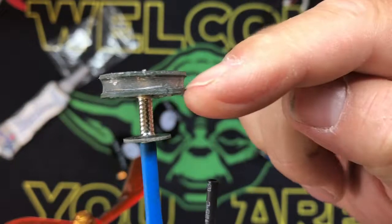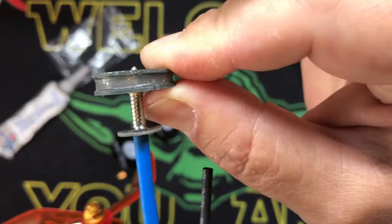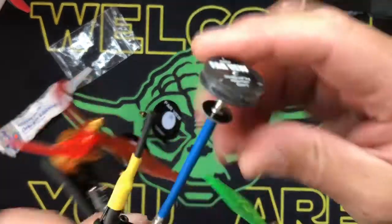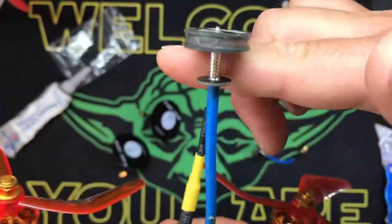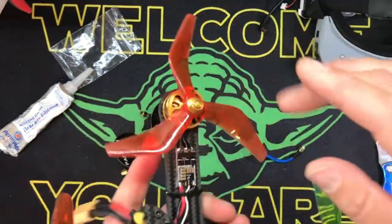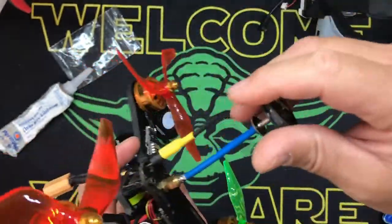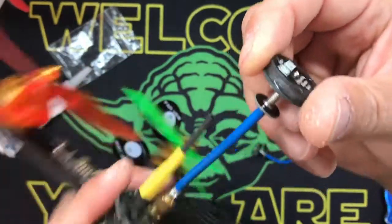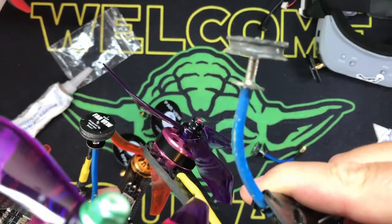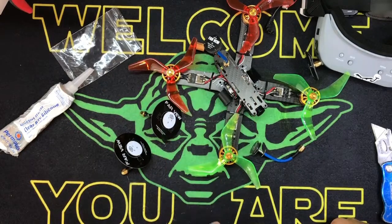Then take your finger with a rubber glove - because silicone is annoying to get off your fingers - and smear it in there, let it sit overnight. What this does is keeps these discs from collapsing together in a crash. These two discs and the third are your tuning - if you crash and they get bent together, your frequency is going to suffer. This is something you absolutely should do whether you're using a FarView or any other pagoda style. It does not affect your range - I've tested this.